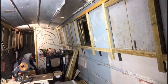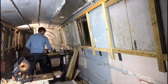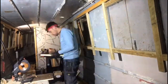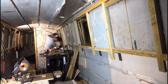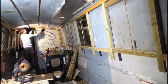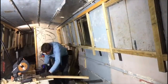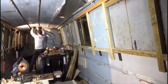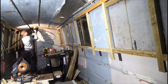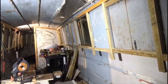Sorry the camera angle is not particularly useful on this shot, but they're mostly straight cuts. The important tool to have here is a bevel — I've actually got a sliding bevel that I use, which will help you get the exact angle on the cut that you require. The important thing for me was to get the upper rail on the starboard side going in at a nice tight joint, so it held the rod in place against the upright, the top part of the bulkhead wall.